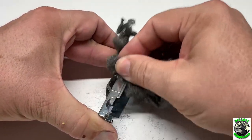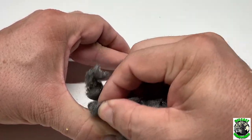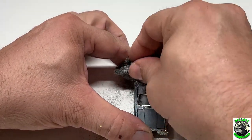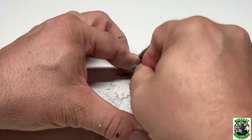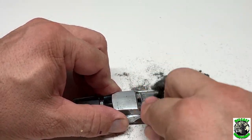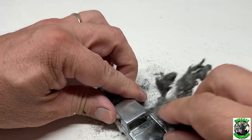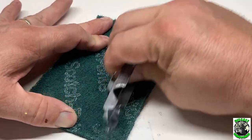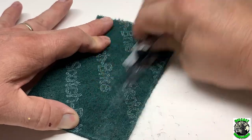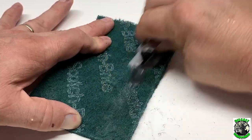If I don't have to, I don't like taking sandpaper to my cars — there's just something about it I'm not crazy about. I do it occasionally, but if I don't have to, I won't. So get in here with the steel wool, scrub it down as best you can and get as many of the scratches out of there and any of the stains and toning. Let's try a Scotch-Brite pad now. I like using the green one, but there's a black one that's a lot more abrasive. Just rub it back and forth and you'll get a lot of that toning and scratches out of there. This works extremely well for me.